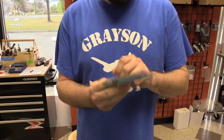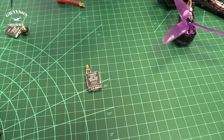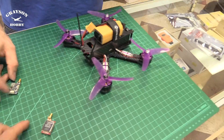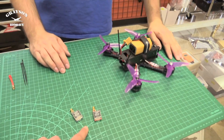We've got two flavors for a quick plug-in option — no soldering. We've got a 200 milliwatt and a 600 milliwatt option, so you can pick your flavor. Why would I choose 200 or 600? The factory's 200. If you're flying with other people, 200 milliwatt is probably the better choice — 25 milliwatt for racing is what you're supposed to use. If you're flying out by yourself, 600 milliwatt is fine. If you're flying around a lot of metal or smaller areas, stay with the 200 or even 25 milliwatt. 600 milliwatt will get more noise if you're in a building. Contrary to what you believe, 600 milliwatt is not always going to be better — it's more powerful, but if there's more RF bouncing around, it's going to be worse.